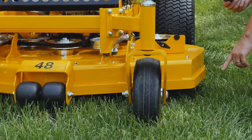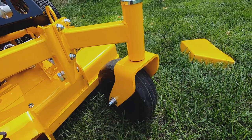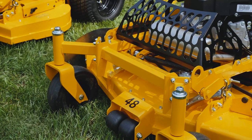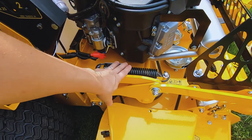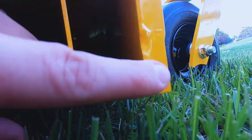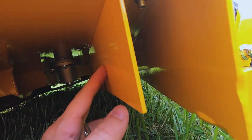The big B has pneumatic tires. It comes in a 48 and 52 inch deck, which look very similar — just a little bit wider, symmetrical on both sides. The big B has a slightly heavier deck, so we have an assist spring inside. We have a setup very similar to the AeroCore deck. The differences are that the nose is different — it's perpendicular instead of angled out — and we've welded a piece on there for reinforcement. The baffles have almost the same locations but are made up differently — this edge here is a bent piece of metal instead of a perpendicular welded piece.